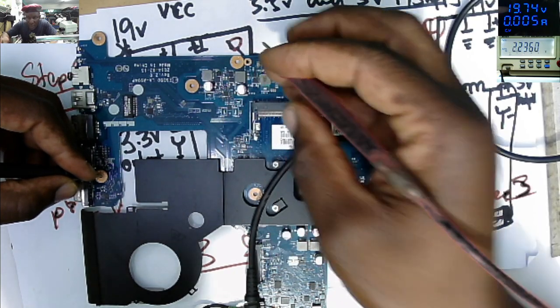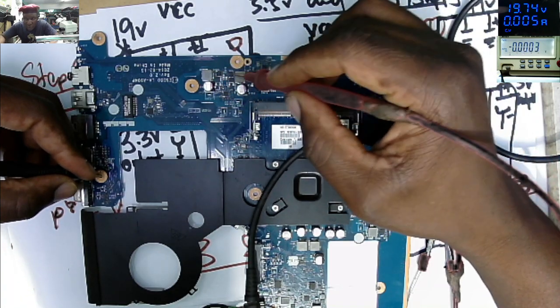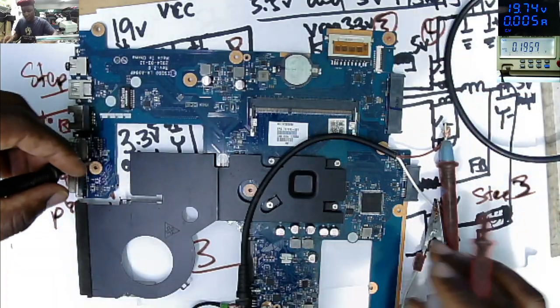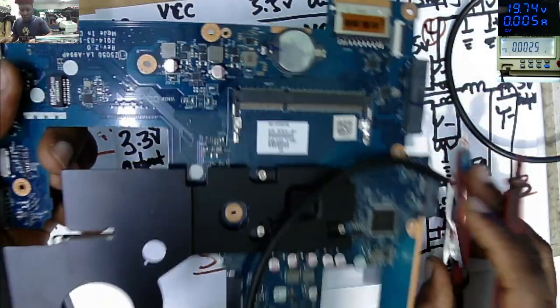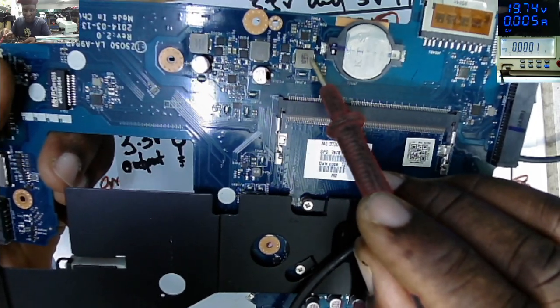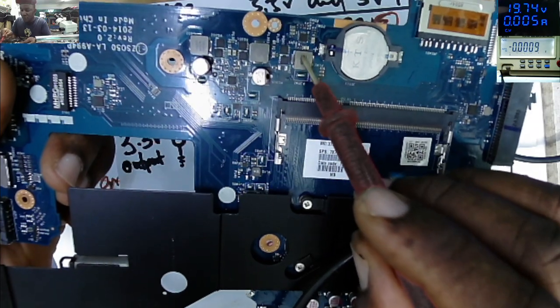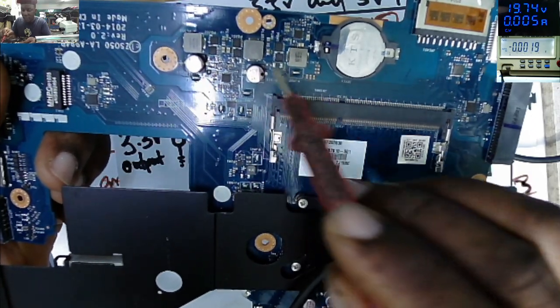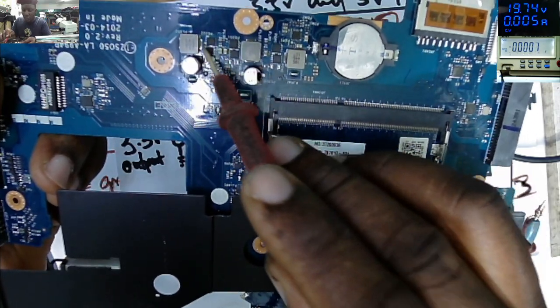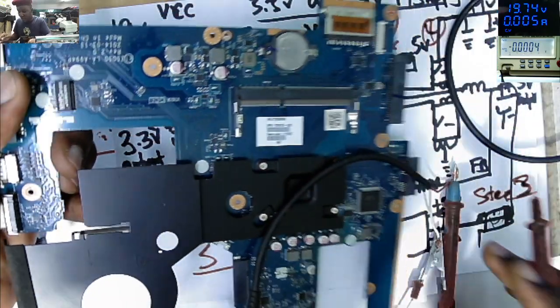And here, you can see this power supply. Two coils, four MOSFETs. Maybe I can bring this closer. This coil is next to the RAM socket, so probably this is the RAM power supply. And here we have two coils, four MOSFETs, output capacitors, and we have the driver.